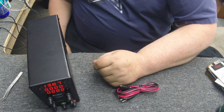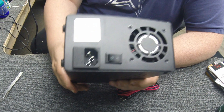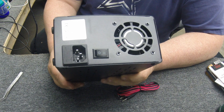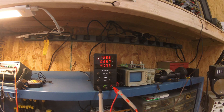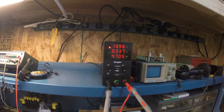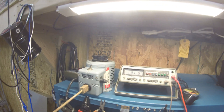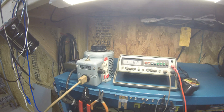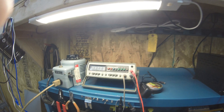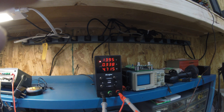She's rated at 10 amps, so I'll give her a hookup and see how she does. It's got a cooling fan on the back, a power switch, and a standard three-pin connector. There she is all hooked up — I've got her connected to the CB I'm working on right now. As you can see I've got it set to 13.95 volts. I've got my multimeter over here and it's showing 13.87 to 13.88, so about 0.07 off — probably a little loss in the cables, which is pretty accurate.